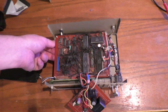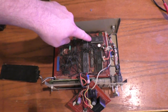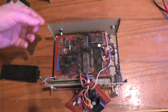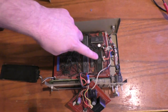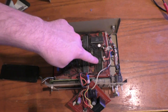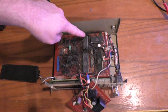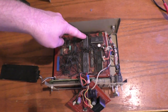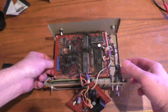Taking off the ribbon cable, you can see the main board which has the SID chip, 64K of SRAM, an 8255 port chip, a 6510, some glue logic, and a 300 Hz interrupt source. That 300 Hz feeds into the 8085's interrupt on the board below, which divides by five or six and pulses the IRQ line on the 6510 — that's how it does 50 or 60 Hz playback. This is a very basic SID player made on RadioShack perf board.